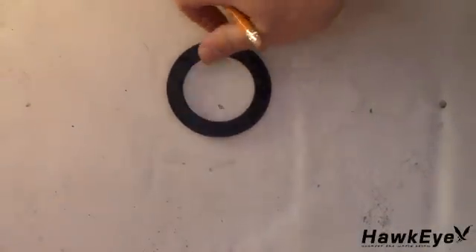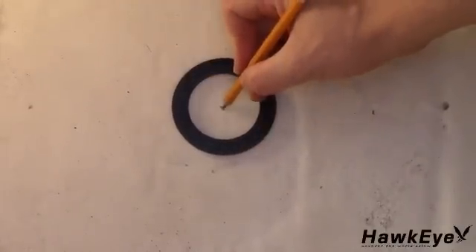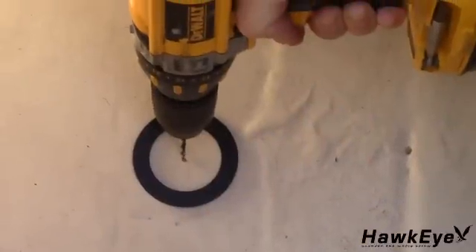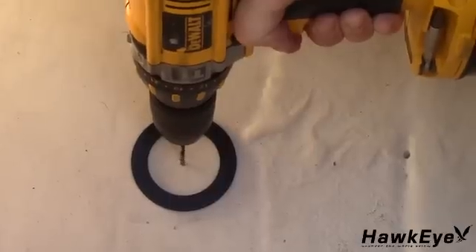To get a good view of the mounting location, put the vessel out of the water, position yourself at the transom, and look at the bottom of the hull towards the bow. Using the illustrations in the manual, note anything that could interrupt the clean flow of water to the transducer mounting location. After selecting the mounting location, place the rubber gasket inside the hull against the mounting location, ensuring that there's at least a half-inch of flat surface area around the rubber gasket.